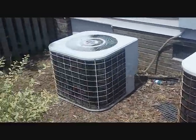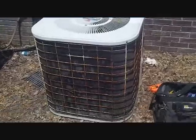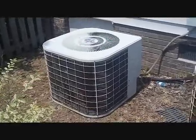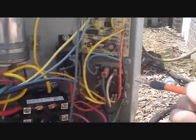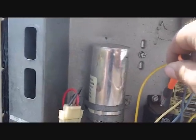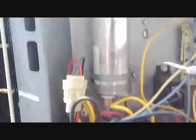Here's a high-efficiency Heil from the early 90s — actually put a lot of these in when I first came to work. My father was a Heil dealer back then. Inside there's quite a bit going on: a defrost board, delay timer, double-pole double-throw relay, another relay, and a contactor I previously replaced. It looks to me like we have another bulged capacitor.